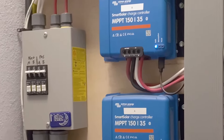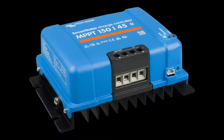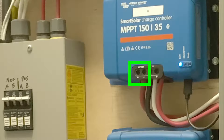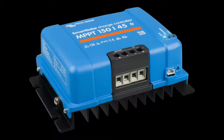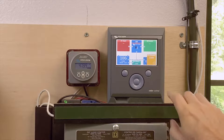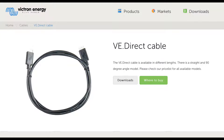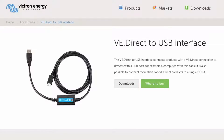Let's look at the wiring — it's very simple. You can use up to 6-gauge cable. The order is important: first, connect the wires to your battery, positive and negative. Second, connect the wires from your solar panels, again positive and negative. This is also where you plug in the VE direct cable, which in my case hooks to a color control monitor. The VE direct cable is totally optional — you can also get a VE direct to USB cable and hook it to a PC.